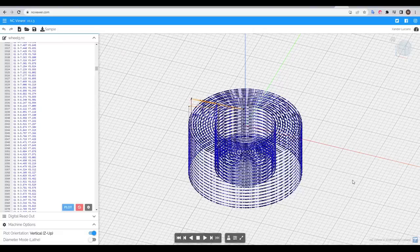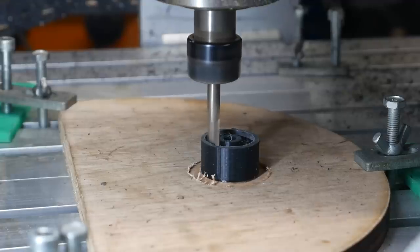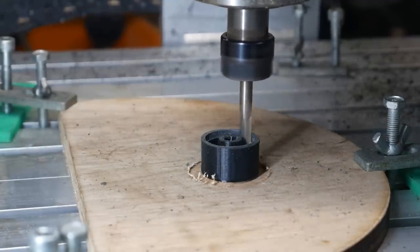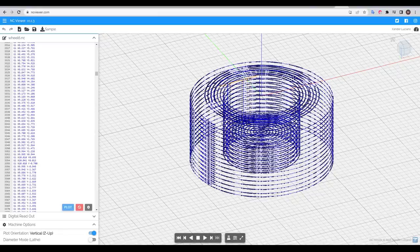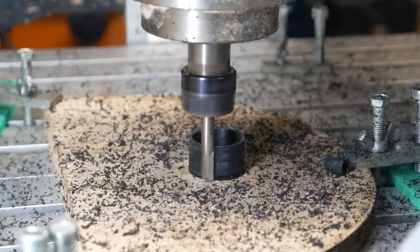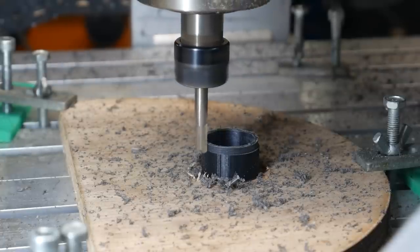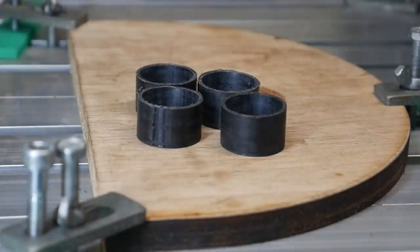Iteration 5 looks the same but is more efficient — it splits the inner and outer portions of the job into two separate parts, so the cutter could continuously work in one area rather than going back and forth. You might have also noticed I switched to only climb milling, which on paper should give a better surface finish. There was one change for the final iteration: in an attempt to combat the vertical lines being left in the surface of the outer wheel — which I believed were from repetitive vertical movements — I introduced a ramping strategy rather than a vertical movement for each layer change, seen here with a zigzagging downward movement. And with this, I had a very reliable way of machining the wheels.